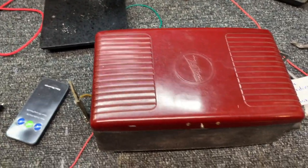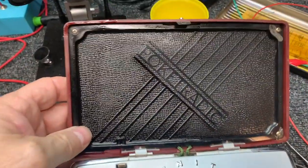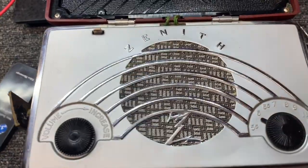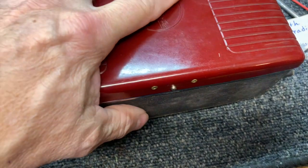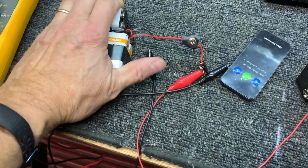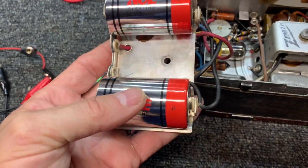Here's a Christmas treat — a Zenith model pocket radio, a 1941 all-original set according to the label, and my daughter got this for me for Christmas. It's a so-called pocket radio — isn't it gorgeous? It's got an on/off switch that works with the lid, volume control, and tuning for AM. I've got a 63-volt battery pack I created — it needs 67 volts but this should be plenty. It also uses two 1.5-volt D-cell batteries for the filaments.